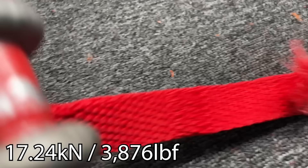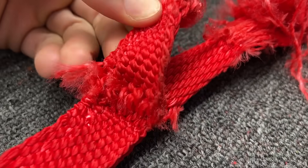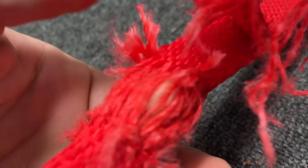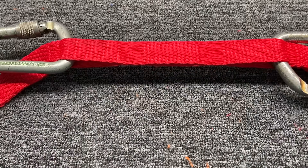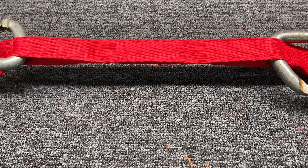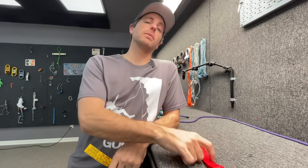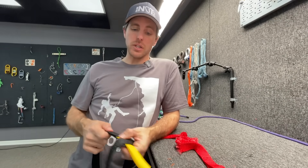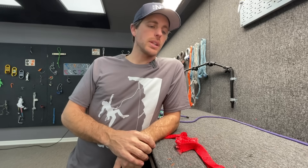It's a little bit stronger this time — it could be stronger because I'm using 5/8-inch pins. Let me use a carabiner and see if it makes any difference. It kind of rips apart the actual fibers. Let's see how that longer stitch looks after it's been broken. It keeps breaking the same way each time — just that little bit of a weave pattern difference was almost 1,000 pounds of force. So they did actually get a lot closer, and I'm way more impressed than I thought I was going to be. But it still wasn't 5,000 pounds, and I'm not quite sure what to think about that other than to start the conversation here on the channel.